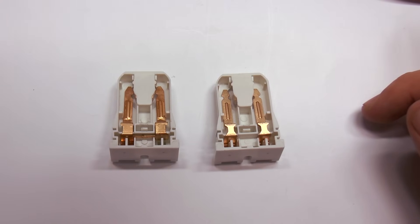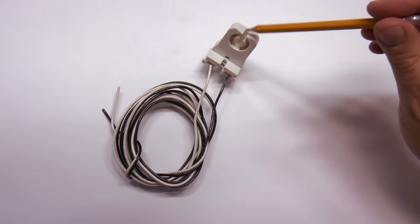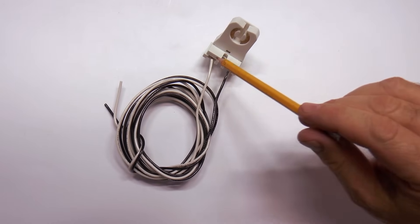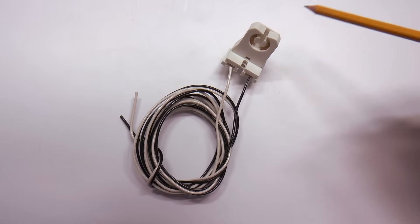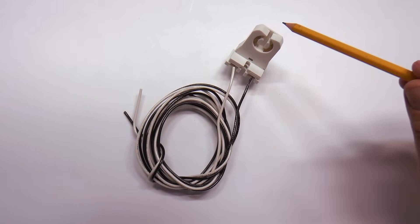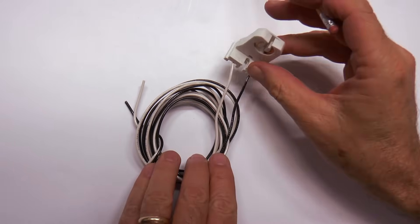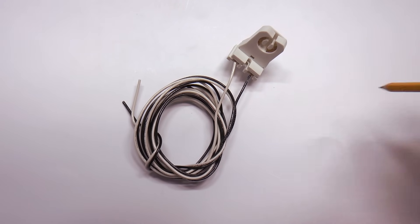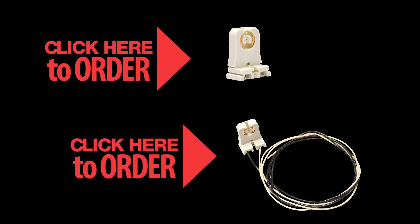Let me show you the wiring harness so you can see what we ship. This is our non-shunted connector, or socket as some people call it, with an 18-gauge wire going in each side supplying 120 volts to a T8 LED retrofit. Just wanted to give you an idea of what they look like when they ship — it's ready to go, just put it in your light fixture. Please see our other video on how to put it all together. Thanks for watching, and if you'd like to order, we've got them on our website.